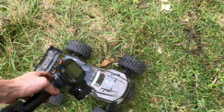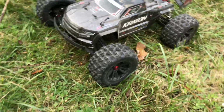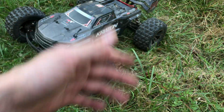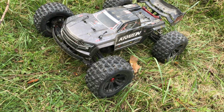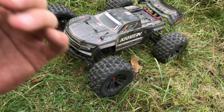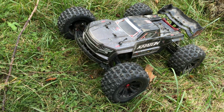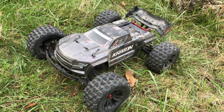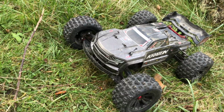Yeah, the pins must have broken. I'm assuming that's what happened. I've had people on the channel tell me that you got to watch out because those pins will break. And I'm wondering if one of the pins or both the pins are broken, or giving out or something, or hopefully they haven't wallowed out the metal spool, the aluminum spool. That's what I'm worried about. I'm worried that the spool actually got eaten away and eroded. That would be the worst case scenario. Better case scenario would be if the pins just broke. But it's kind of catching at times, other times it's not.